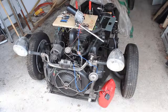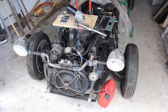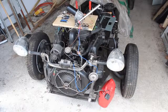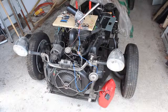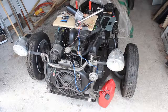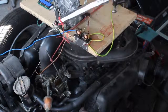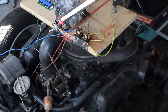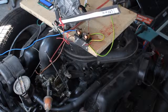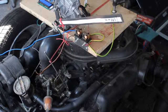The control loop moving the throttle lever is not a straightforward PID mechanism treated before in this video. The carburetor flap is not closed completely as soon as the given revolution speed is reached, instead it has to stay at the actual position. If the detected revolution speed falls below the set point, the throttle has to be higher, while it has to be lowered if the actual revolution speed exceeds the set point. If the measured revolution speed is within a given interval around the set point, the servo lever must stop moving.